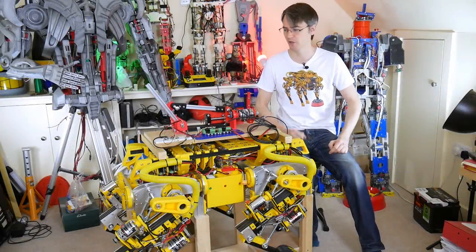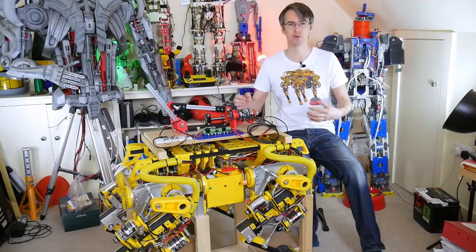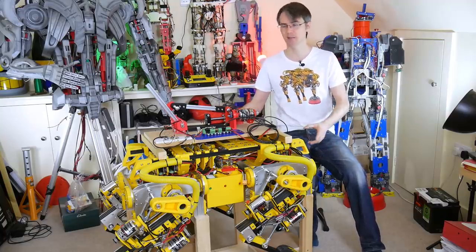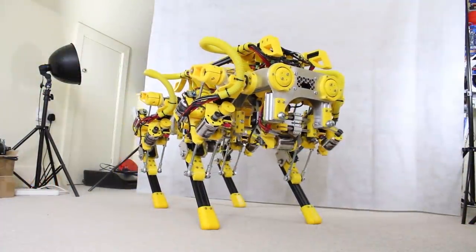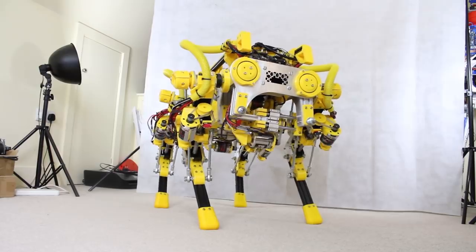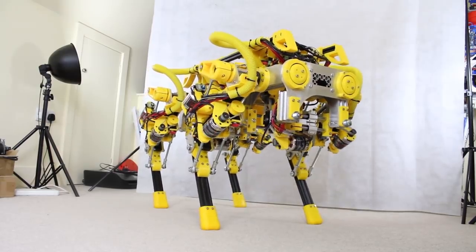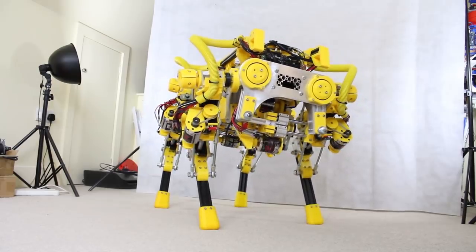Hello, it's part 15 of OpenDog, the open source quadrupedal robot. This project is an ongoing project where I'm now showing all of the detail we've got as far as most of the mechanical build. We put some electronics in and did a kinematic model that means all 12 motors will stay in sync to move it in three translation axes and three rotation axes. That's as far as I pretty much planned before I started the build, and we got that far and now we've gotten to trying to make it walk.